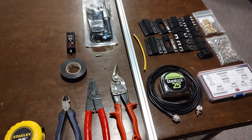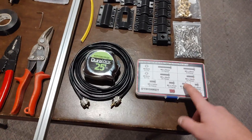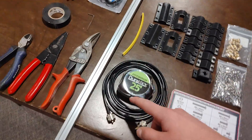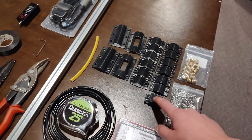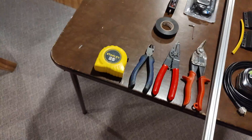For our components, we're going to need a 1 meter piece of extrusion, tape measure to cut up. We need some M5 hardware, M5 T-nuts, and 3D printed components to connect our extrusion to our tape measure. We're going to need some heat set inserts, 1/4-20 thread for our tripod adapter, and a piece of coax.